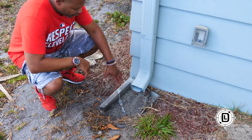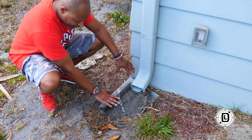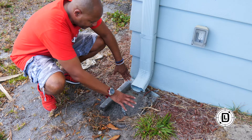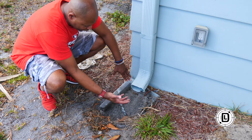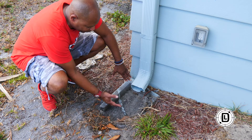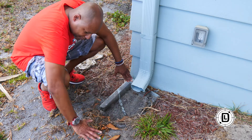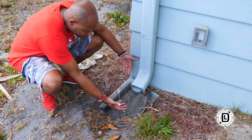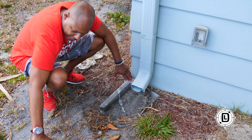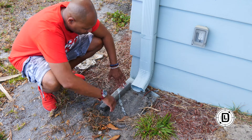Normally I could just dig this out, flatten it, and slope the land — build it up with some dirt so the water moves off. What the Stealth Flow does is diffuse the water coming off so it doesn't have time to sink into your foundation. I'm going to dig this out, level it, slope it away from the house, then take the Stealth Flow out to here and put the drain in that area to move the water away and drain it down.